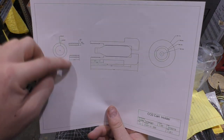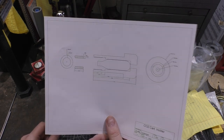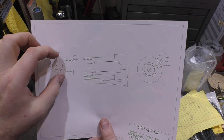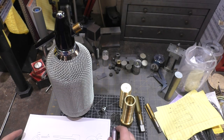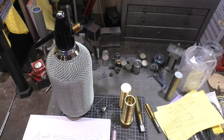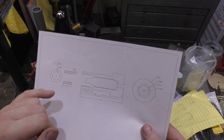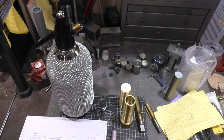The challenging part will be this bushing, I think, because the wall is somewhat thin. It's about 62 thousandths thick. So I won't do the inside first. I will do the outside first, thread it, and then I will drill and tap the inside. Fortunately, I have taps and dies for this. I don't have to single point that. I'm using metric because the inside threads are already M18 1.5, and so the outer I'm going to do M24 1.5, which is just under an inch, 25.4 millimeters to the inch.